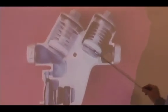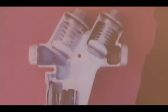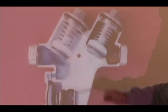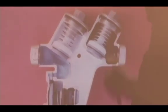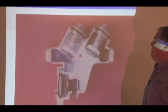Here's an actual case where you can see what the replaceable check seats look like. You can see where they're sealed in by an O-ring. And same on the double check, that same basic configuration. So basically, if you cut the bottom half off, that's what the double check would look like in the 40-100 series. But the 200 series being the RP, of course, the first check has a heavier spring load.